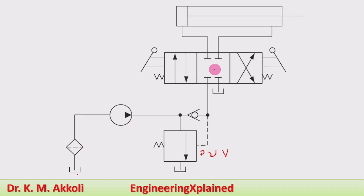The direction control valve is used to operate a double-acting cylinder. During its central neutral position, there is no operation. When the direction control valve is switched towards the left envelope, the pump flow will be connected to the double-acting cylinder and extension of the cylinder starts, while fluid from the rod-end side flows back to the tank.